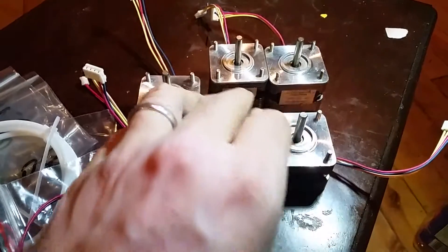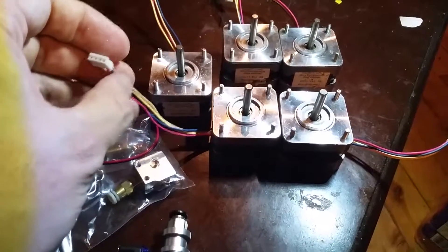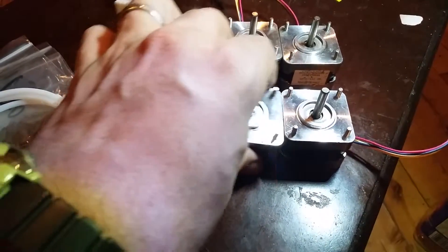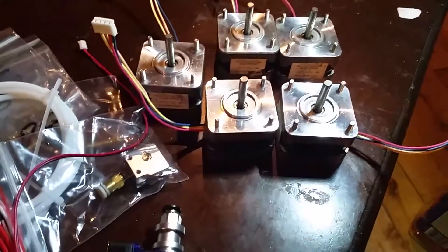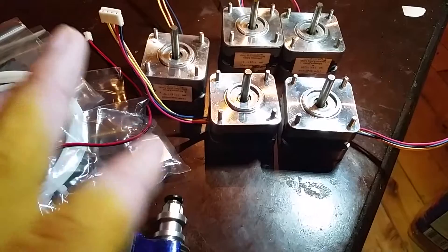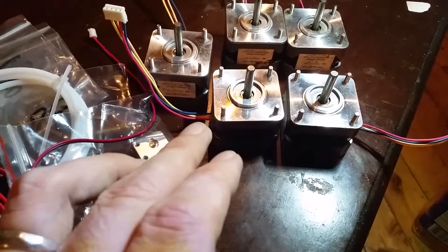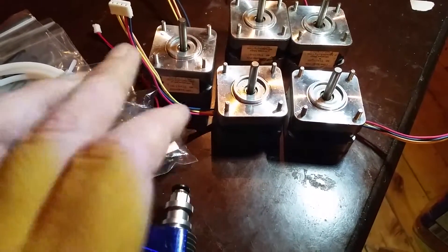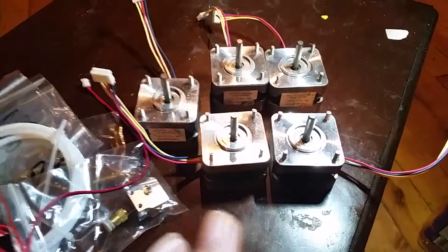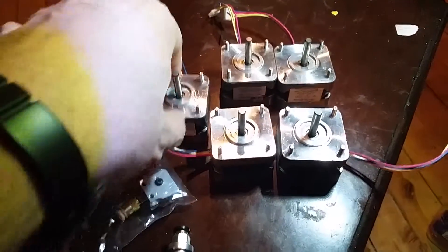The wires being damaged - it's mostly the blue wire, which has a slightly different texture and seems weaker coating than the others. I think it got caught between the edges of the motors in shipping. That's not too bad an issue anyway, because these wires were way too short and I was going to be taking them off and soldering on much longer leads. If I have to open these up, there should be some terminals or leads to the actual coils on the inside, but they were going to be replaced anyway, so that's not a biggie.